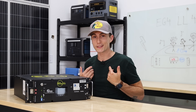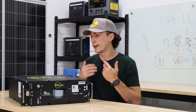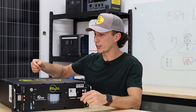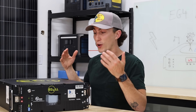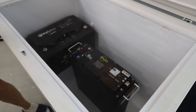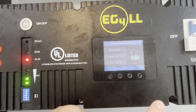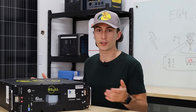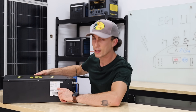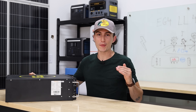One of the most important things for us to know is whether the temperature sensors actually work in real life. We live in a cold climate, and if batteries are left in a cabin with no heat, they will get extremely cold in the wintertime. So we threw this thing in a deep freezer and left it there for 24 hours. We got the cells down to negative 27 degrees Celsius, which is not unrealistic — we've seen temperatures as low as negative 16 degrees Fahrenheit. The sticker says it'll discharge down to minus 20 degrees Celsius, and we got it well below that.